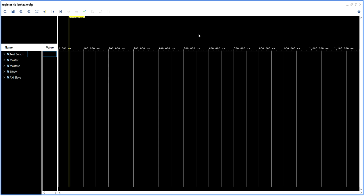My name is Michelle, and I wanted to learn how to write VHDL code. It was suggested to me that since the most basic thing that happens in an FPGA is that you read and write registers to configure it, the best way to learn was to write an AXI master driver that interfaces with an AXI BRAM. That's how this project started.